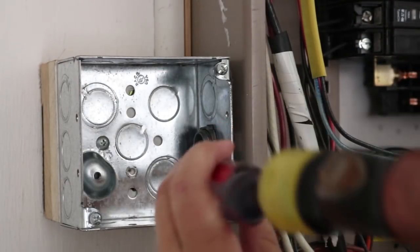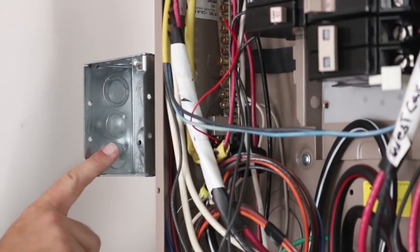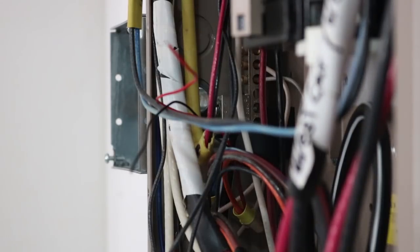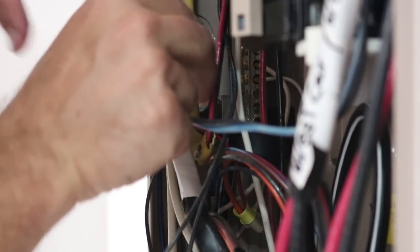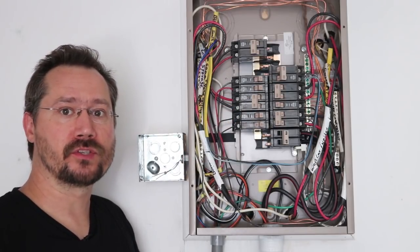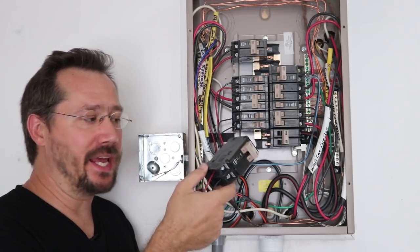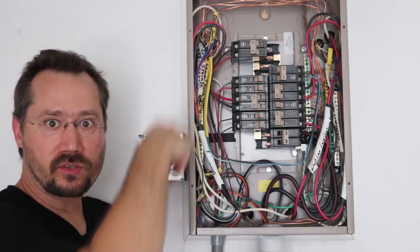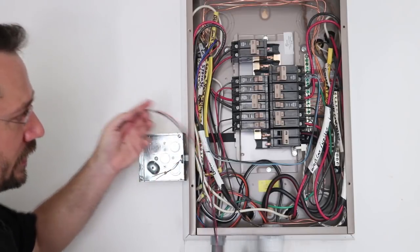Locking down that nut by tapping on it with a hammer and screwdriver. With the box in place and connected, I'm going to take those current sensor wires and push them through so they come out in the box. Because the panel meter needs its own power source, I could tie it into any of the 240-volt breakers, but I wanted to give it its own — so I'm adding a 15-amp 240-volt breaker. I've already got a pair of wires on it. Normally you'd pull your wires through the system and then install the breaker, but it's a little tight so I put the wires on the breaker first.